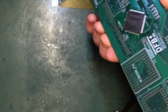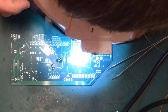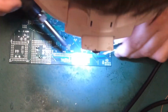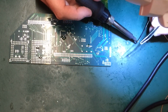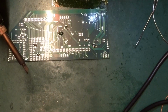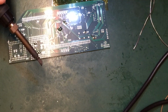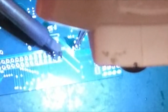And here you can see the problem, because I've soldered that CPLD on, the board is now unsteady. As you press down on it for that second pass, you can hear it click quite often as it levels out. See if you can pick this up. I'll just turn the extract fan off for a second. See if you can pick this up on my mic. So pressing down on it now, I'm going to dab in. There. Did you hear that?